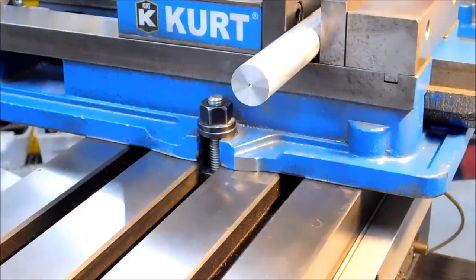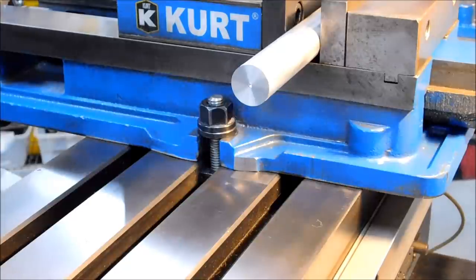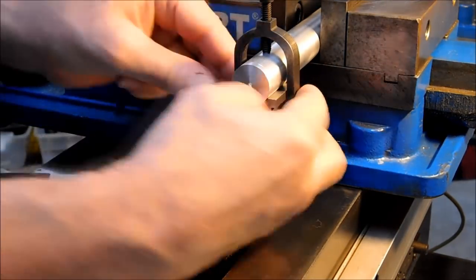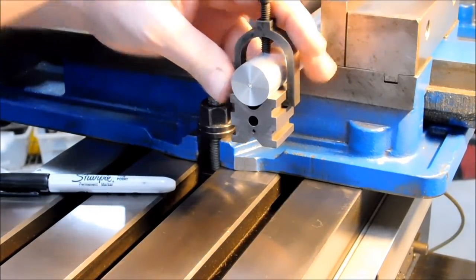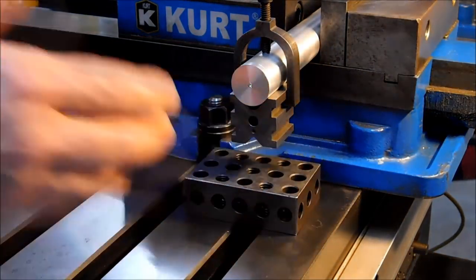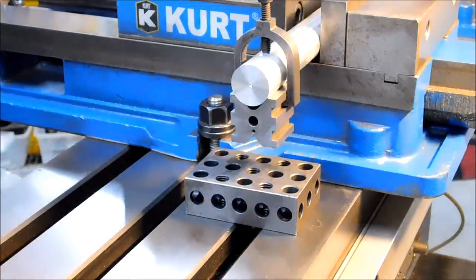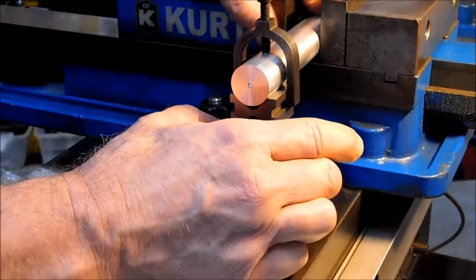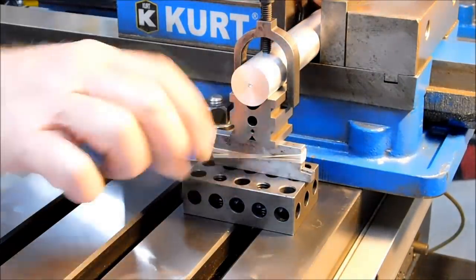Here's your workpiece. For reasons unknown, we cannot put this workpiece in a collet, can't put it in a collet block, can't put it in an indexer — it might be too big, too long, or whatever. I'm going to show you a couple of ways to move this around. One of the most popular ways I've seen is to put something on the outside of your part, like a V-block — hang something on the outside that you can use as a reference. Now we have two vertical surfaces and a horizontal surface you can use to index your part. Make sure that before you start, you register the part in some degree of repeatable format. What I have here is an adjustable parallel with a rubber band around it and a 1-2-3 block.